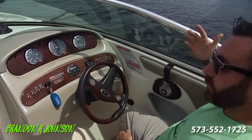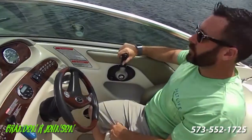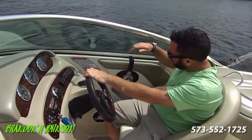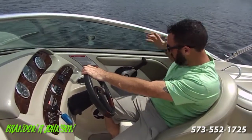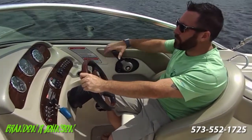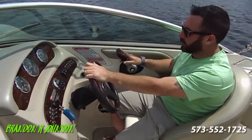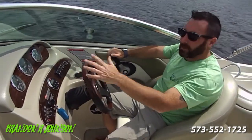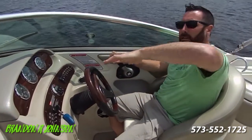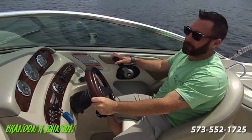Shifting is very smooth. You've got the little red trigger here — you lift up, there's a definitive catch for forward, then your throttle range is beyond that. Neutral. Reverse — throttle range is beyond that. So it makes this boat extremely easy to maneuver because you have precision control. A lot of people get excited to drive and as they accelerate they've got their finger on the trim-up button — and the boat's not going anywhere because the out drive's out of the water. That's no good at all. So go back down.